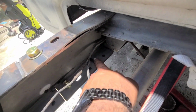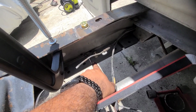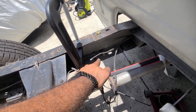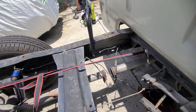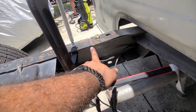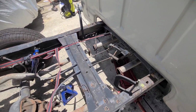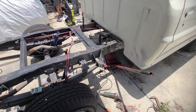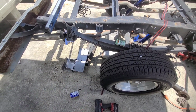So I cleaned up, so the welds will be going through there. We're going to have to weld this section here as well. I'm going to try to open some of these holes so that we can get some bolts in there. And again, around 6 bolts is going to go in that area. It's also going to be welded on the edge here, and obviously what I already cleaned up there. So yeah, it's coming along, but that's how much we took off, about 16 inches.